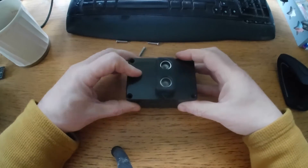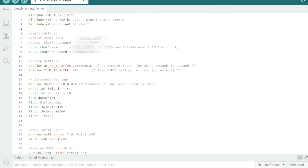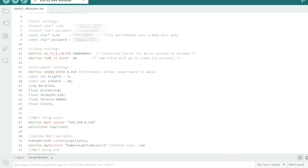Let's have a quick look at the code and see what's going on. I'm not giving a demo on Wi-Fi, so this assumes that you know how to connect your ESP32 to Wi-Fi and how to use MQTT, which is the way it communicates with the Raspberry Pi to send the packets of data. So there's all the Wi-Fi stuff and the settings.